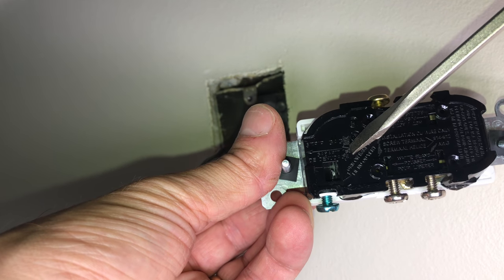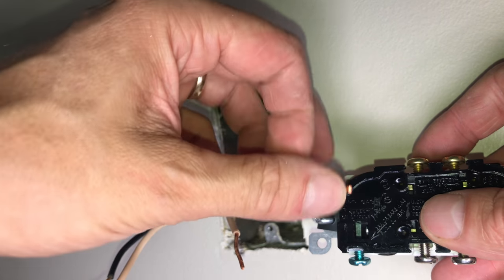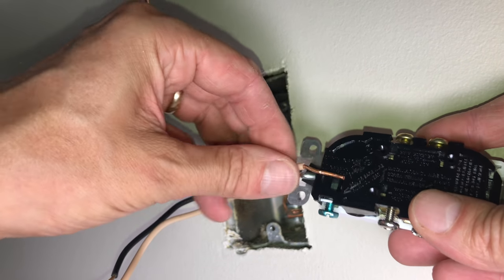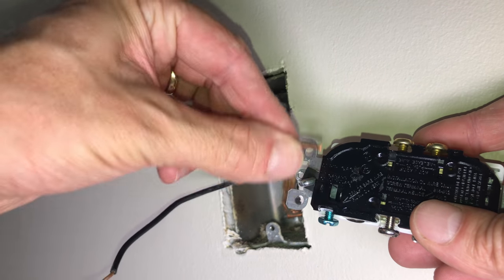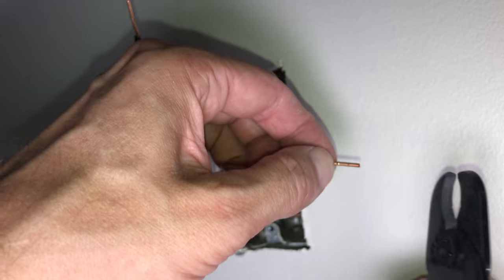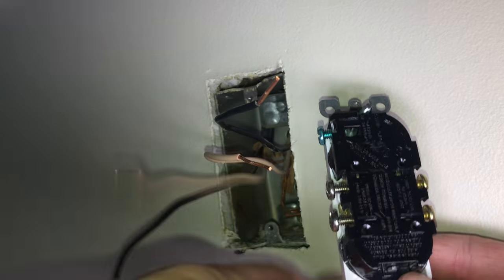We just have to make sure we strip off just enough insulation from the wires. To do that correctly, you'll find a strip gauge on the back side — see that little arrow? That's how much insulation you're supposed to remove from each wire. I'm going to check this with the old wires. Luckily most of them are already correct. The first one is exactly right, but the next one appears to be a little too long, so I have to shorten it by cutting a little bit of wire off. Once I've checked all four, I can connect them to the new outlet.